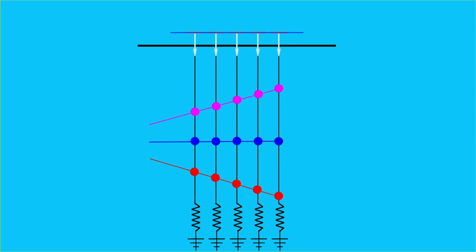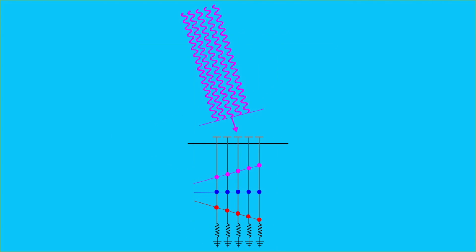The wavefront has encountered the dipoles. The wavefront induces very tiny feeble currents in the dipoles, shown as those white arrows flowing away from the dipoles. They'll be amplified later on. The currents are encountering the pink directional couplers, but it's intended that they go to the blue directional couplers, so the pink ones have been turned off so the currents can safely flow by. The currents turn the corner at the couplers and head for an amplifier, represented by that small green triangle. And look, we have a little blue blip. We've detected something. Hooray!